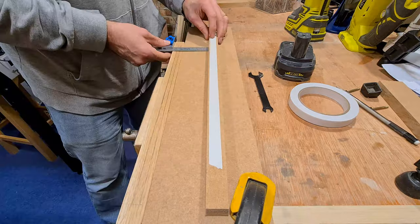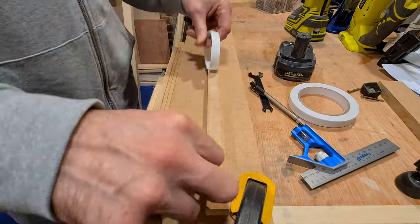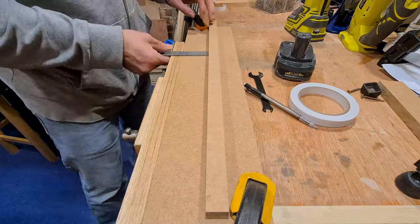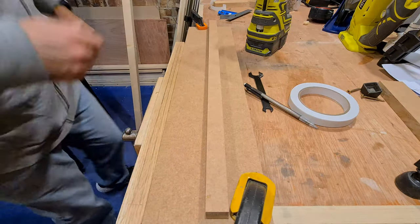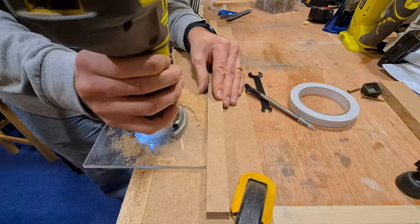As the glass edge against the lockdown bar is nasty and chipped, I need to hide it. So I marked out where the glass touched the lockdown bar and set up this fence system to give my router a chance to redeem itself. I have a new mask. Scary, eh? Taking just a small amount each time, I checked it on the machine for fit.